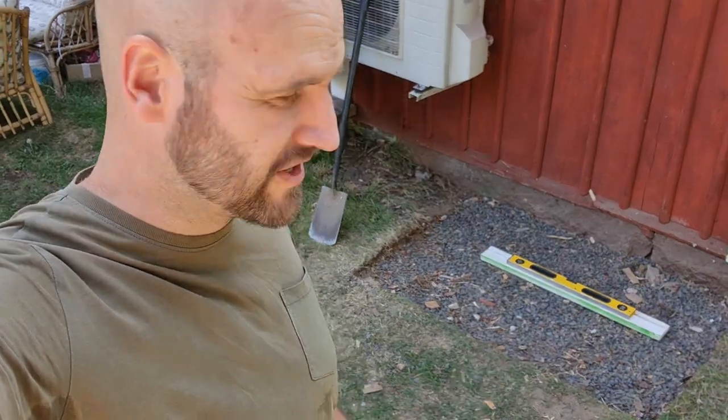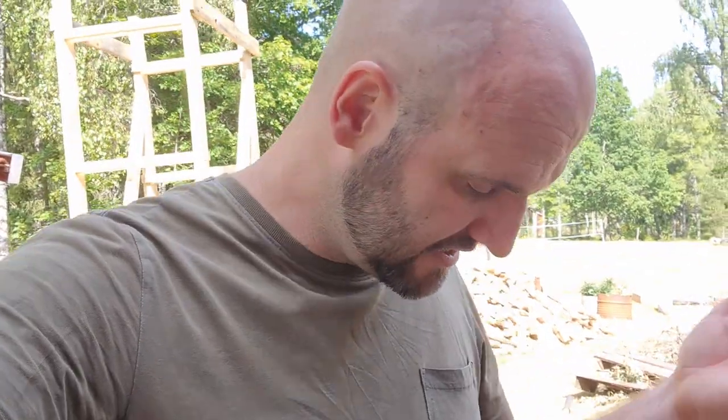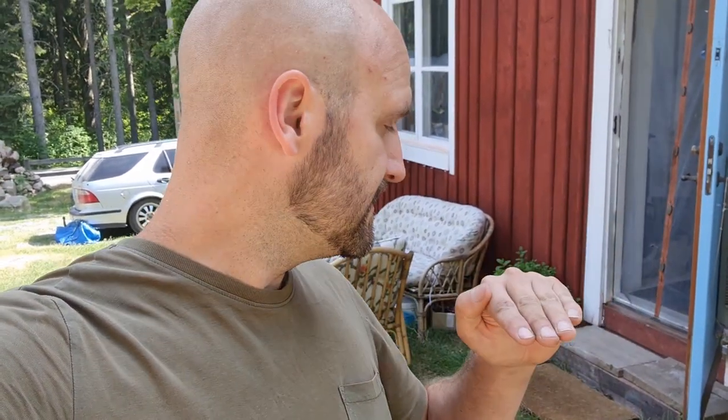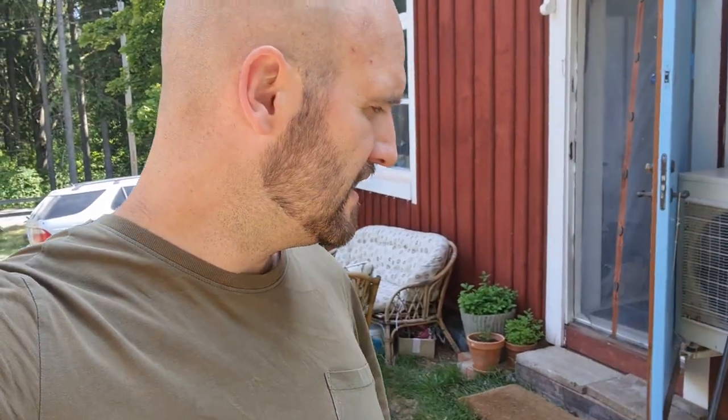This was a lot of hard work. I should also mention that this is my first time. I've never done this before. I've never put concrete on anything in my life. So I looked up a couple of YouTube videos on how to do it. And that's what I'm doing. I first dug out a space where I wanted it, made that as level as possible, compressed the dirt. Then I put on a layer of gravel, compressed that again, made sure it's all level. And that's all according to the YouTube videos I'm following. The next step is to make the wooden border.